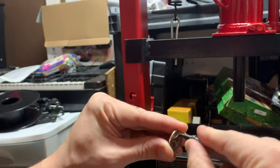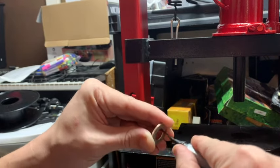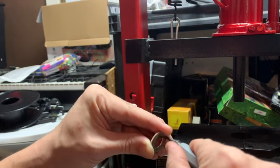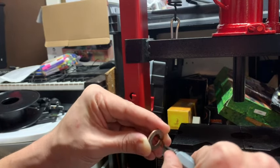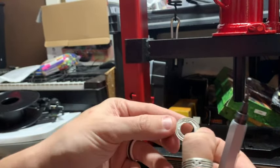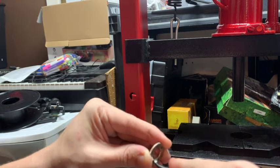I do my deburring over a trash can. What I do is put this deburring tool in at about a 90-degree angle and then rotate it around until the inside is smooth. I'll just cut away all that sharp edge in there. Deburring tools are super useful — I highly recommend getting them. You could use sandpaper, but to maintain the detail on the coin this is probably the best way. I just clean them up until I can feel they're smooth — I trust my hands more than my eyes.